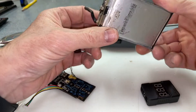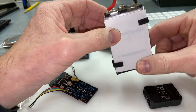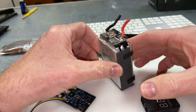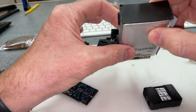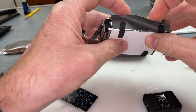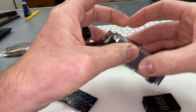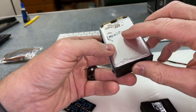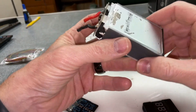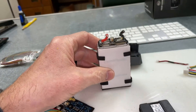Getting a new battery. But this one's not a total loss — we're going to turn this into a flight pack, like a park flyer. It can't be used on the DJI anymore, but it's still usable. The cells are great, no swelling in this pack. These batteries are in great shape. It averages out for a 14 watt-hour battery at 3.8V — about 3,800 milliamp-hour, about 1,200 milliamp-hour per cell. It's not completely a loss.